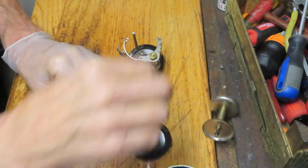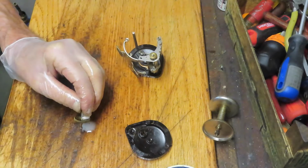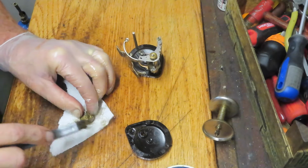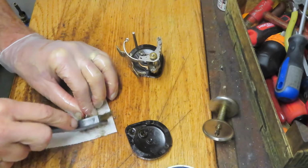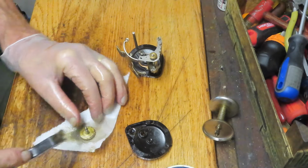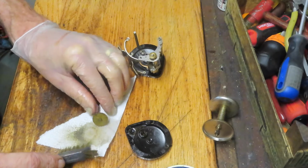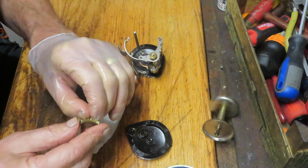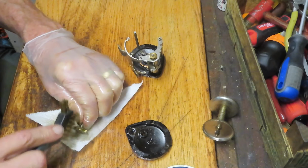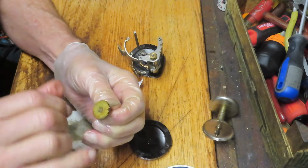On our main gear, we want to remove the shellacked grease on that. It's all dried up and out. So a little bit of penetrating oil. Pull through on the... I'm using a brass brush for this. You can see how it's cleaning up the gear. And check your teeth, make sure that they're not full of old grease. You can use that same brush approach. And then check the teeth from this side. Make sure that those angles are nice and tight.